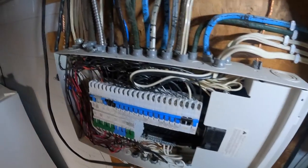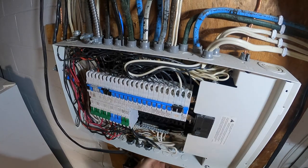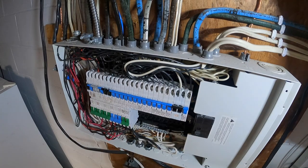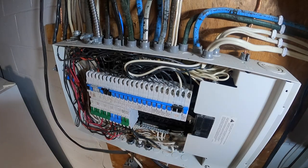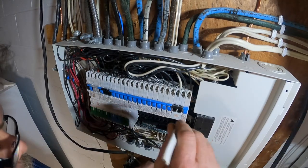I put in my strain relief fittings — the wire goes through and you tighten them up, so they're in. Now all you gotta do is feed this wire through. Make sure you're careful and gentle. We'll go through here like so and bring it up around. Sometimes these are a pain because they've got a groove designed to take one wire, so it's pretty tight.